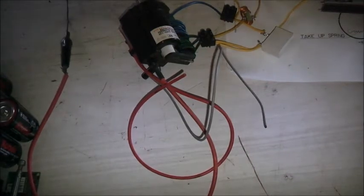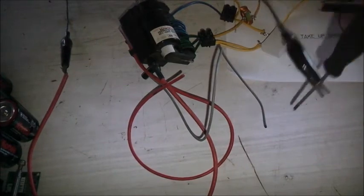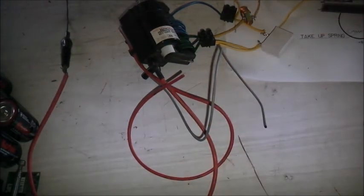Let's have some more fun with the Flyback. 0.5 amps arcing, not a problem there. That's funny. Yeah, it's arcing in the hot glue. Oh yeah, the hot glue is copping all the arcing and carbonising. It's probably going to short those two pins out. Yeah, well, as long as the hot glue is getting damaged. Sheet of paper there getting the corona.